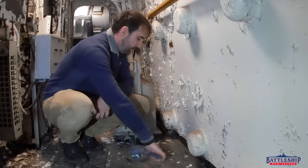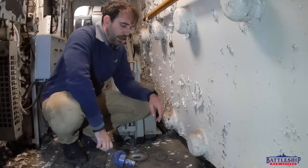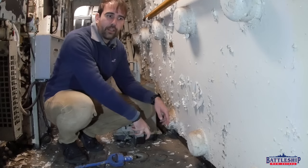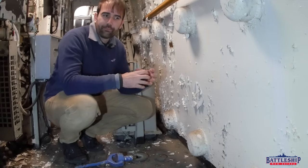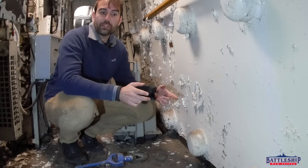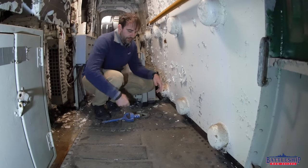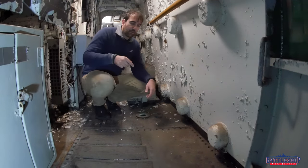When I put my key in here and go to turn it, it spins freely — there's no tension on it whatsoever. As a follow-up for those who haven't watched the last video: when I am turning this, it is basically turning a screw that is lifting a big pin set into a hole drilled in the barbette. So when the gun is returned to face straight ahead when you're not using it, you use the centering pin to hold it in place. Something is clearly off about this one, and we're going to explore and find out what.